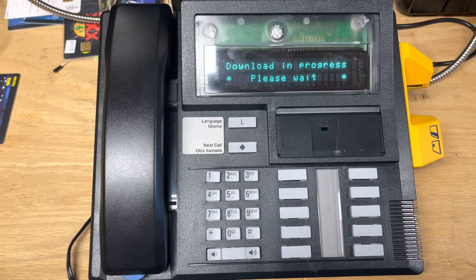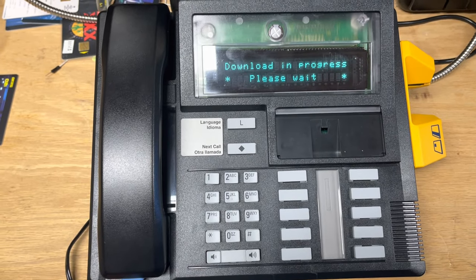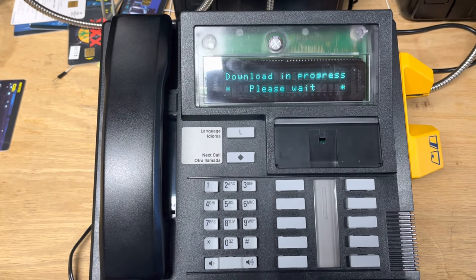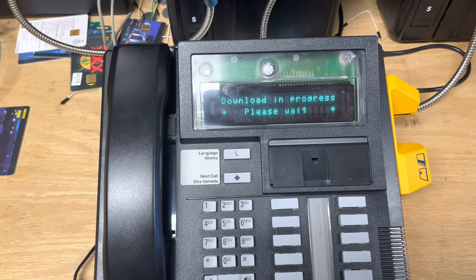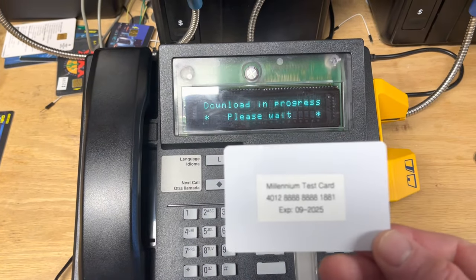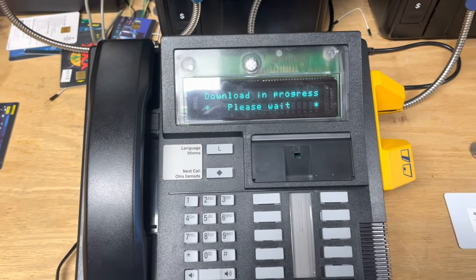The desk terminal is a little bit different than the other Nortel Millennium terminals in that there are no locks and keys — at least no physical lock and key — so to get back into the terminal after installation we will need to use a card key. A card key is just a credit card type card programmed with a 10-digit number, and you can use any credit card you have for this function, but in my case I made a test card. This is the number that MMManager uses by default for the card key, and I'll show how that works after the terminal installation is complete.